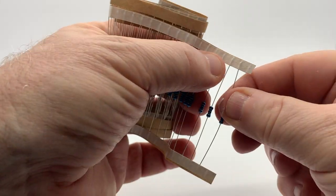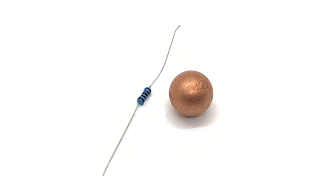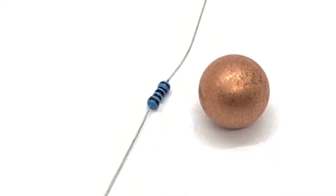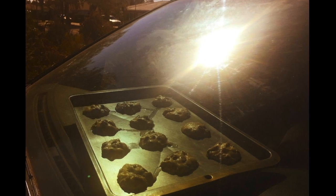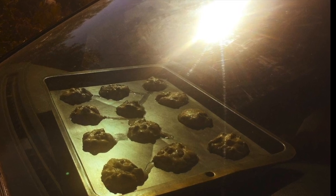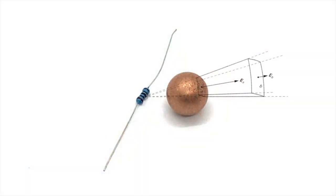For the heater, we're just going to use an ordinary resistor. Resistors like this have a power rating of one-quarter watt, meaning you can pump that much power into it essentially forever without it failing. A quarter of a watt may not sound like much, but the power flux through the surface will be about 5 kilowatts per square meter — about five times larger than the heat flux coming off the roof of a black car in full sun at high noon on a hot summer day. It's so hot that the resistor would create its own air currents, and that's why we need to put it inside a metal ball, whose surface is about 20 times larger, reducing the power flux 20 times.